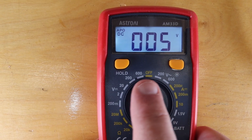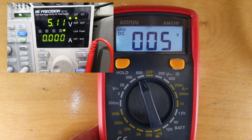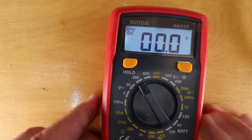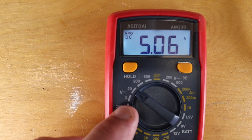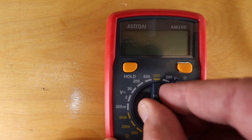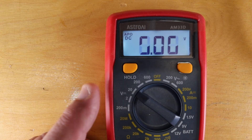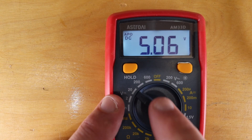Let's talk about how you measure voltage with a manual meter. Generally speaking, you want to start on the highest range. I know the voltage being put into the meter is 5.11 volts. In the 600-volt range it reads 5, but the digits are missing. Going down to the next range gives 5.0, then 5.06. If you go one further, it says OL — overload. With a manual meter you have to think about what you're doing, which can actually be an advantage. Always start high and come down until you can see the voltage with maximum resolution.